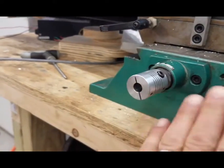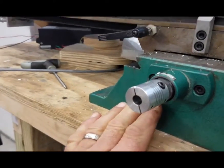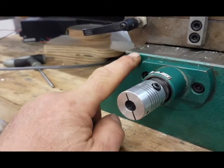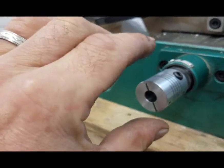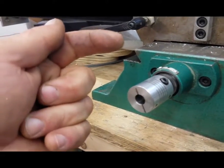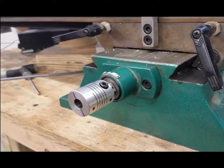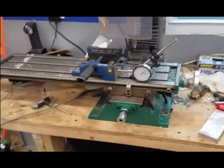The y-axis is going to be trickier and more involved because it's not a flat surface — you've got this bearing assembly to contend with. Plus the big thing is your saddle travels out beyond the end of this, so whatever I use can't stick up beyond here. The motor will be about here so the motor does stick up, but the part that mounts against the machine can't. It's going to have to come out and then have a plate that sticks up to mount the NEMA 23. That'll be a little bit trickier, but certainly doable. I'm just trying to do this simply and cheaply to get myself up and running.